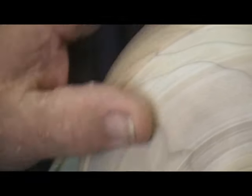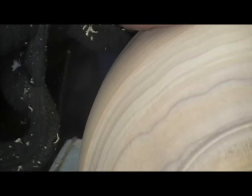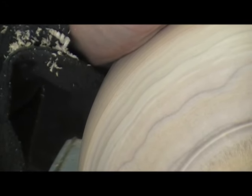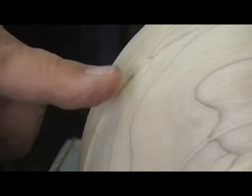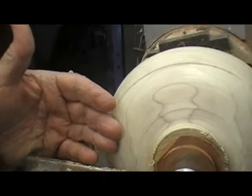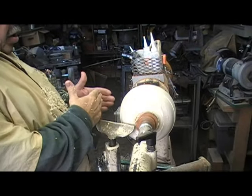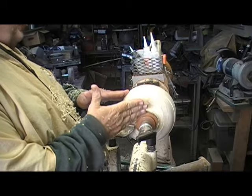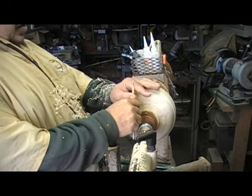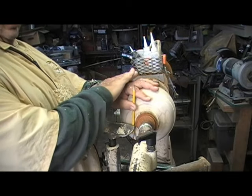Okay, I'm sorry, the tear is gone. G-O-N-E, gone. Now, what I did was I pushed on the end grains, and when I pushed on the end grains, I tore it. Now this is an uphill sweep, uphill. I'm going around the grain. The grain is sticking up like this, and I'm knocking it off gently.